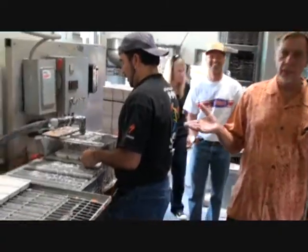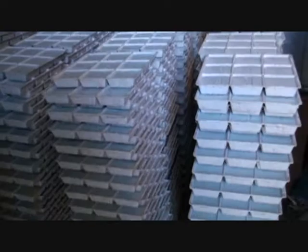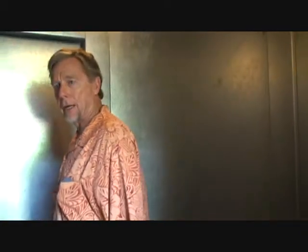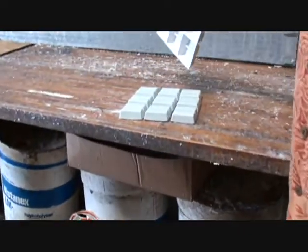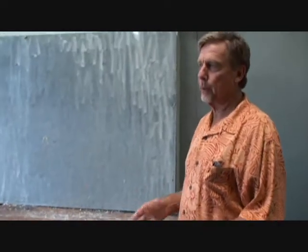Those are the initial steps: blending the waxes, mixing the waxes, filling the trays — which are the molds in the shape of Sticky Bumps. Then they go onto the cooling racks, and from there they go into a freezer. This is a custom-made freezing box that very quickly drops the temperature, so we can rotate these trays two or three times a day. Everything is brought down below freezing. The reason we freeze it is to get it out of the molds — they just fall out of the tray. To unload 15,000 bars takes a few people a couple of hours in the morning.